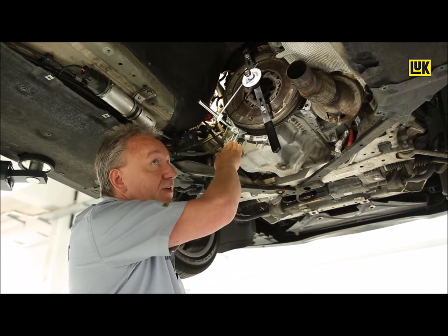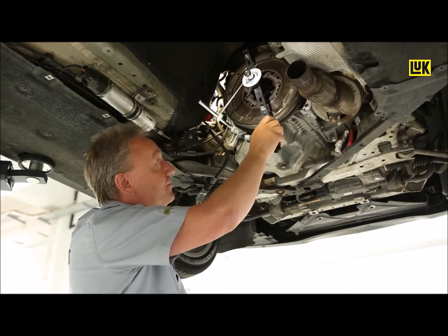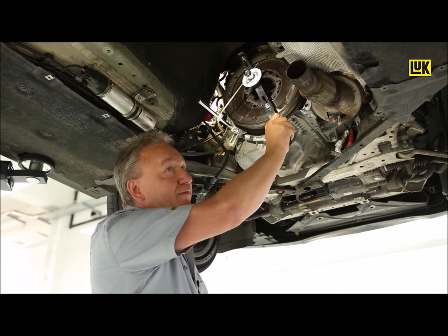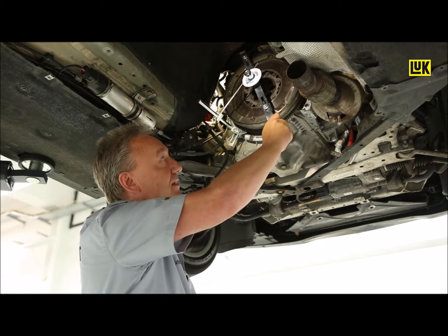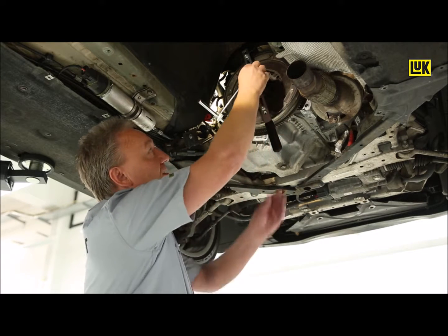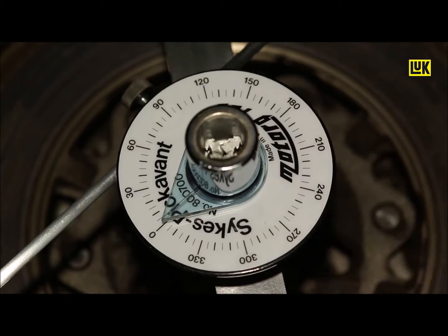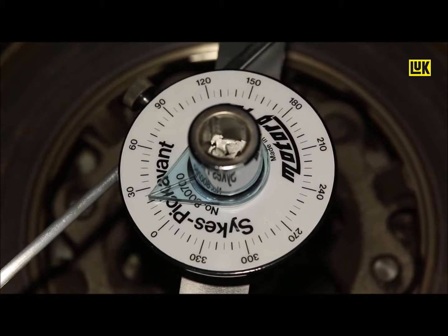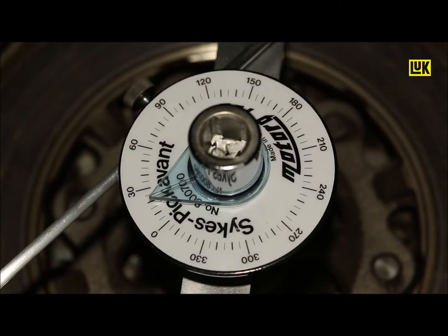As you can see here, we have an even number of mounting screws, so it is placed in the center. The flywheel is locked by the locking dogs, because we don't want it to rotate while the degree gauge is fixed with the slotted arm. We start in a counterclockwise direction, push a little against the spring force into the arc spring channel, then slowly release the slotted arm until the spring force stops. After this, we set the degree gauge to zero. Then we push the arc spring in a clockwise direction, let it go slowly until the spring force stops, and read off the value — in this case, it is 22 degrees.